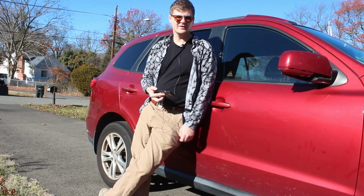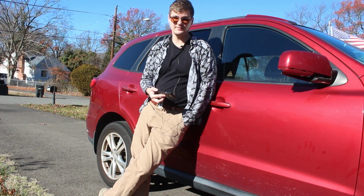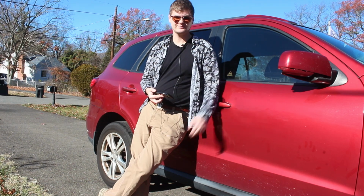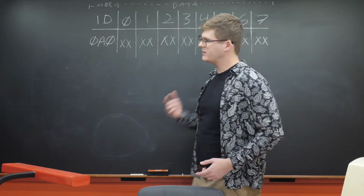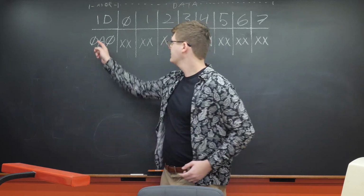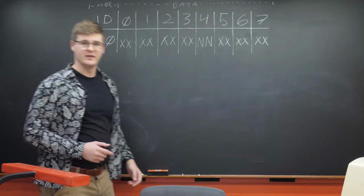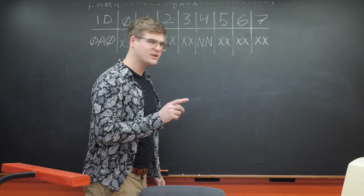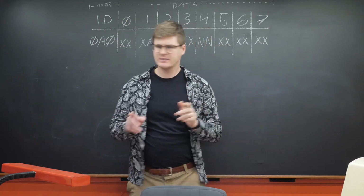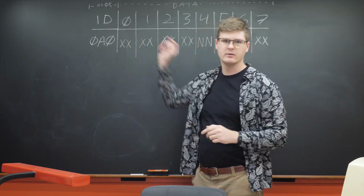And yeah, there we have it. That should be enough data for us to determine which address has the speed data, and also which byte of data represents speed. Upon reviewing the data that we've collected about our CAN bus, it appears that packets with CAN ID 0A0 contain our speed data. This data is presented to us in the 5th byte of our packet's data field. Or maybe it's byte 4, depends if you start your count at 1 or 0.